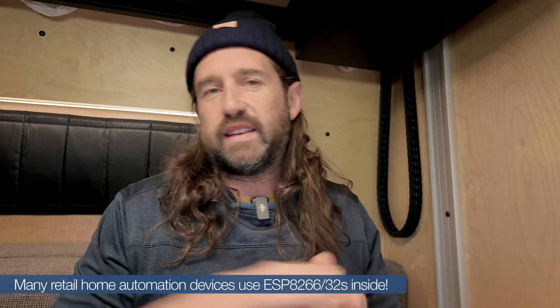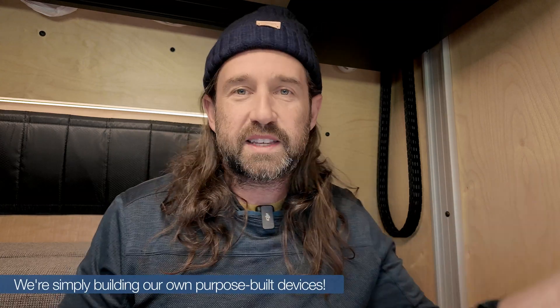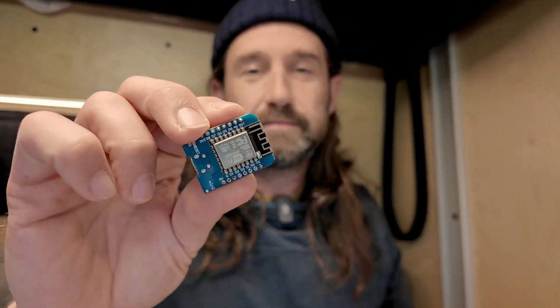So why wouldn't we just buy devices that are already compatible with Home Assistant? Well, that works really well in a home — you might have Hue bulbs or Nest cameras. But in a van, we're going to have some really unique things we want to control. I mentioned a video coming up about our mag locks. Since we couldn't go to Amazon and buy something called 'mag locks for van and Home Assistant,' we had to create it ourselves. We came up with the right magnets and the right way to switch them, but ultimately we need the brain to control that and speak to Home Assistant so we can turn those relays into switches — or better yet, locks — in the Home Assistant interface. You've been voting on the poll on our channel page, and it's really clear that everyone wants to talk about mag locks. We're definitely going to do a whole video about our exact setup, which locks we chose, how we're controlling them, and the YAML configuration for one of these ESP processors.